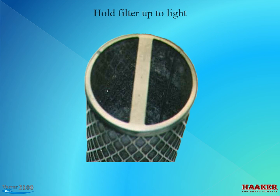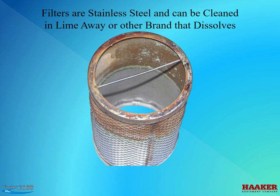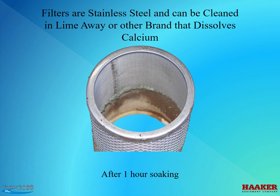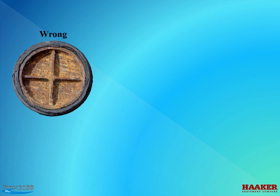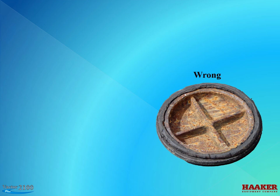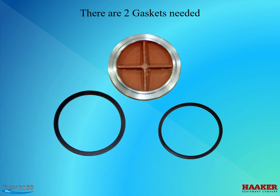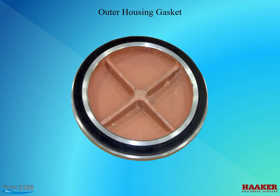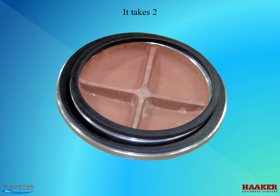After rinsing the debris out, hold the filter up to light. If light is restricted, water will be restricted — this is due to calcium buildup. The filters are stainless steel and can be cleaned in any product that will dissolve calcium: LimeAway, CLR, or other brands. This screen was soaked in LimeAway for one hour to show that the screen can be cleaned and to open the passages to allow water to flow better. When putting the screen back together, inspect the cap and gaskets; if they are getting worn, replace them. There are two gaskets needed — an outer housing gasket and an inner screen gasket — to seal the water and hold the screen tight in the housing.